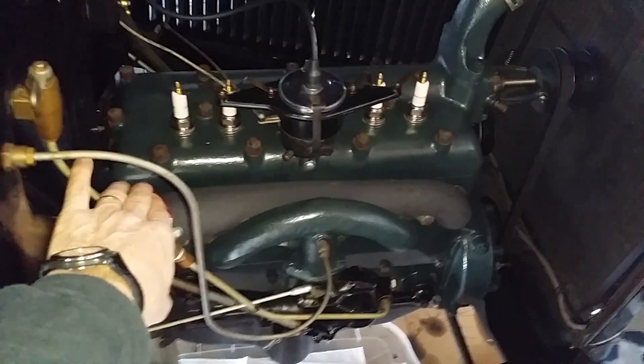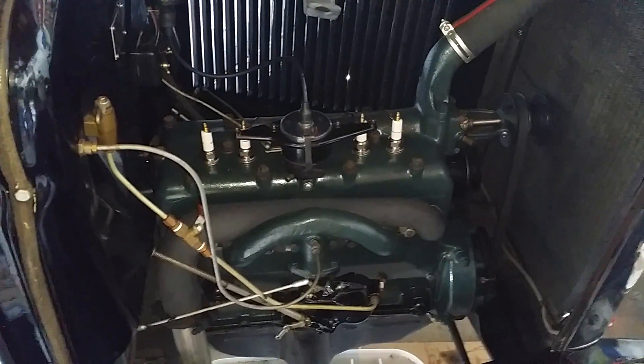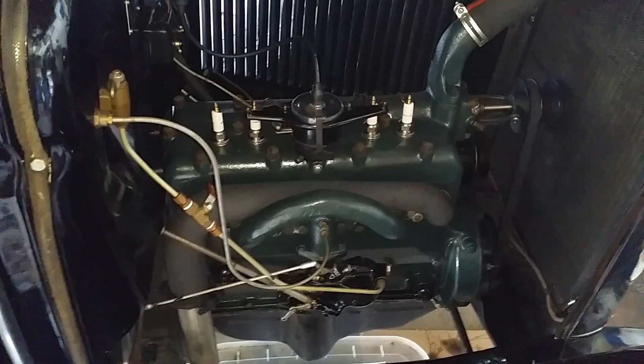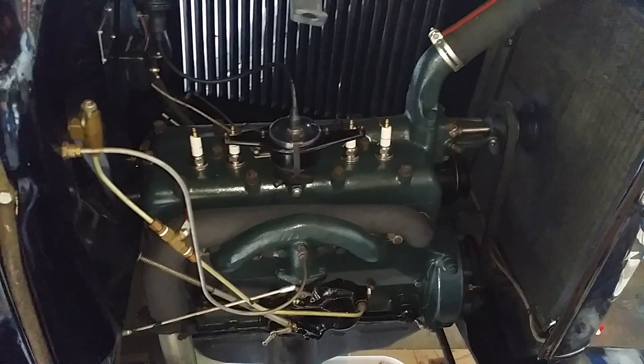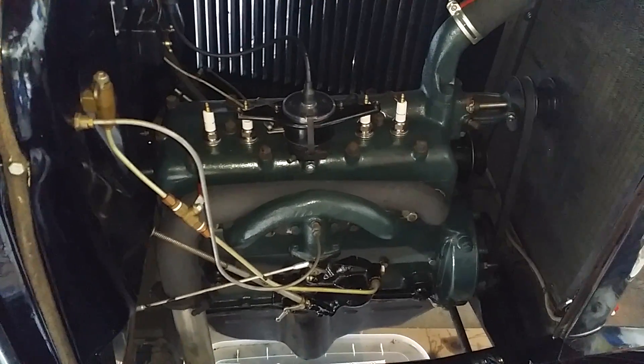We'll see how long it takes. Now the fuel's been cut off. You'll hear this car start to chug. It's going to empty out that bowl. Here we go. So it's sucking out all the gas with as much as it can. We don't want to have any excess fuel remaining.